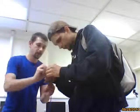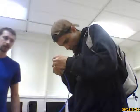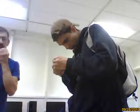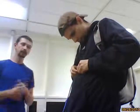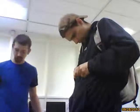You want to always keep your tab facing down. A lot of times, yep. The key is watching when you first get them shoved up in there. And once you get them guided and started in there pretty good, then you can just play with them a little bit. That's the key, because if you don't grip a connector on, you can end up fixing your mispair. That's why I always do a double check and then I crimp.